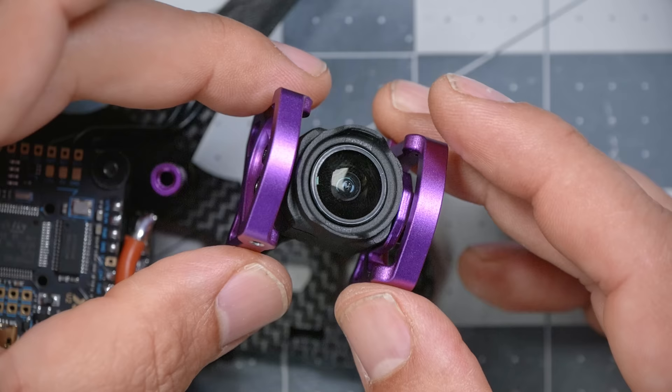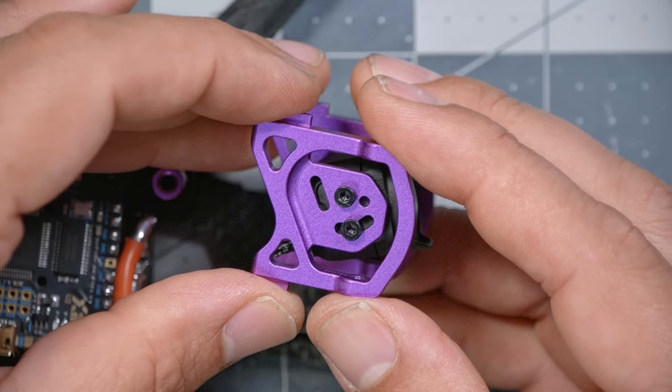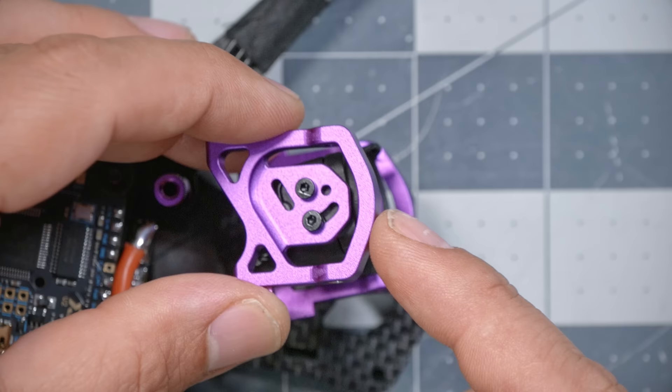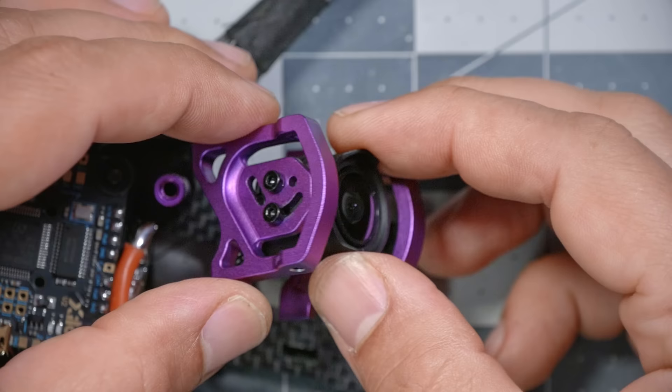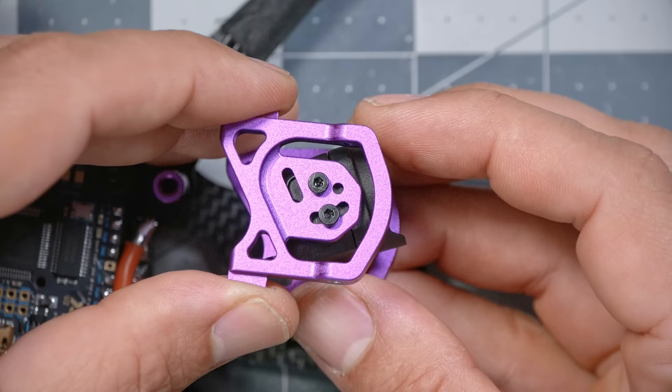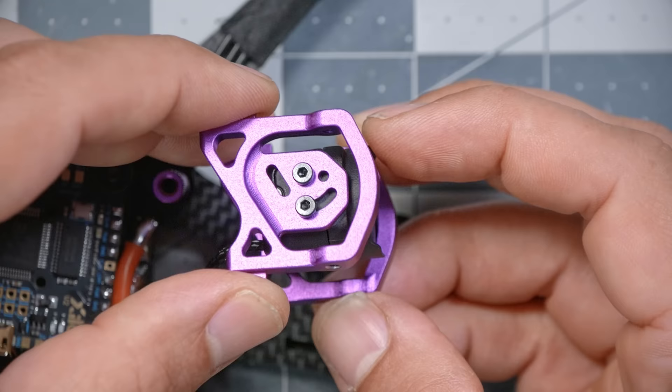The next thing to do is mount the camera in the frame. Install it between the two camera side plates as shown. Please note carefully exactly which screw holes have been used — the camera plates have several screw holes because the dimensions of different cameras are different, and camera placement is important. If the camera sticks out too far to the front, the metal side plates can't protect it in a crash. If it's too far inside, the side plates would obstruct the camera view. We want the camera even with or just a little bit behind the side plates. The curved bottom hole lets us change the up-tilt angle of the camera, which we'll talk about more later.